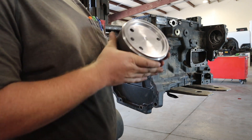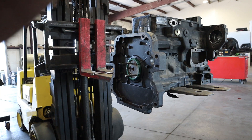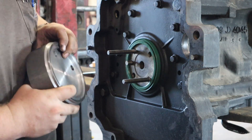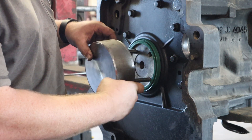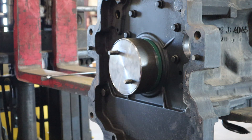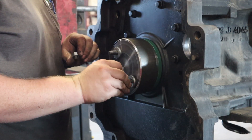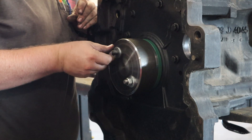This is the seal pusher that I made. It's super overkill — six-inch steel, a little too heavy — but it's material I had sitting around. I have two all-threads, they're just kind of a stud, and I have two spots — I drilled both of them just in case, because you never know which side the dowel pin is going to be on. So this just goes right on there, and that's a good fit. It's only the second time I've used this one. You can buy a very similar seal press online — they're about $180. But this one looks like it works a lot better than those, and I made it, so of course it's going to work.